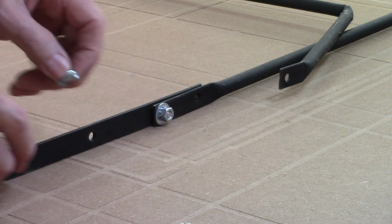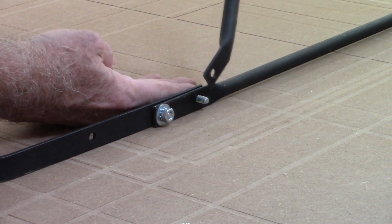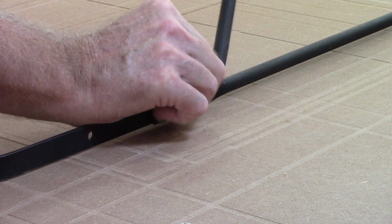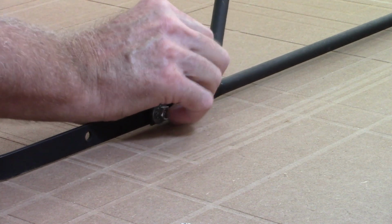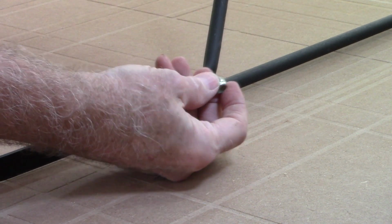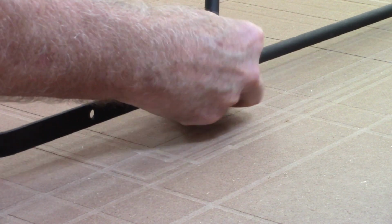Now add the top bow to the front and rear bow subassembly using the 5/8 inch, 1/4 inch diameter bolts. I decided to scrounge up and add flat washers and lock washers at these points also, but this time the 5/8 bolt length worked okay. Note that the top bow is held in place with the stop nuts that come with the kit.